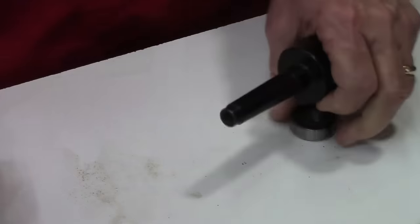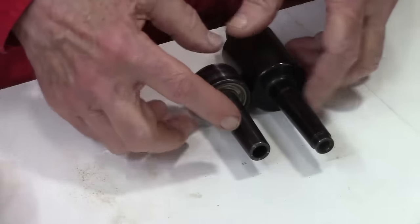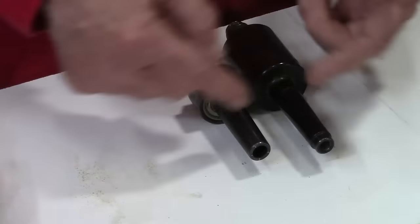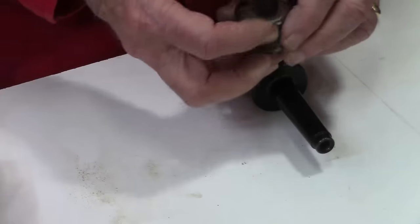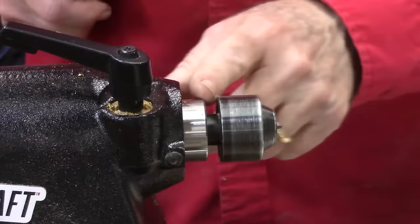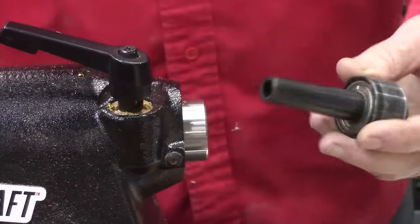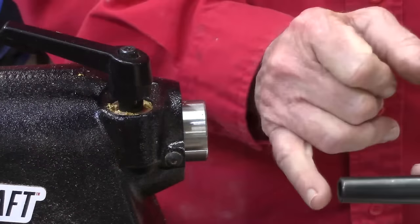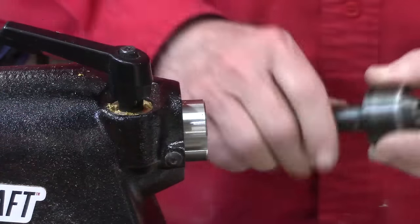Let's talk about the size of the Morse taper. Mini lathes tend to come with what they call a short Morse taper. As a result, it does not self-extract in most large lathes. Either one will fit in a mini lathe, but if you put a short one in a large lathe it'll get stuck — I can actually see some damage here from early on when I probably tried to pry a screwdriver in between. If you accidentally stuck a short one in a large lathe, you can always stick a tool in there and give it a pop. If you wanted to use one in a large lathe, you could put some type of wooden plug or bolt here just to extend it so the quill would self-extract.